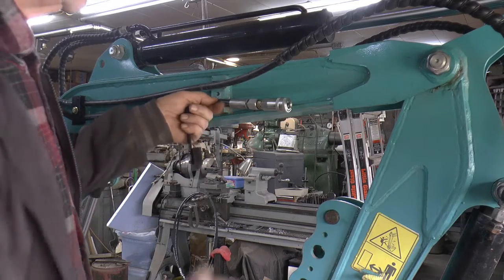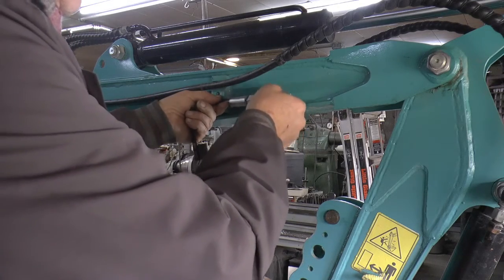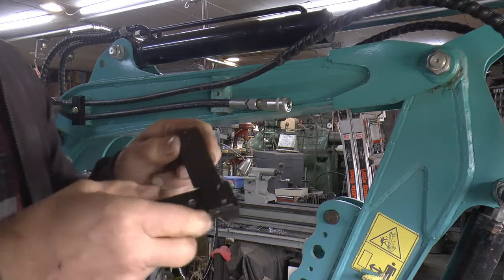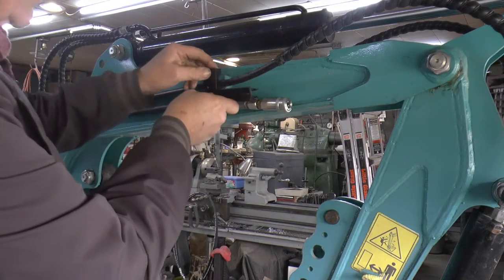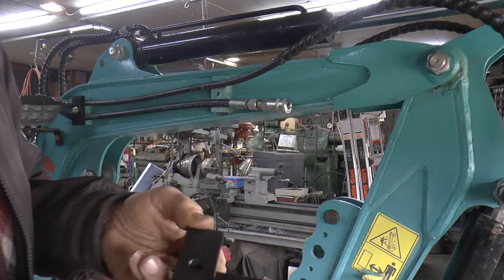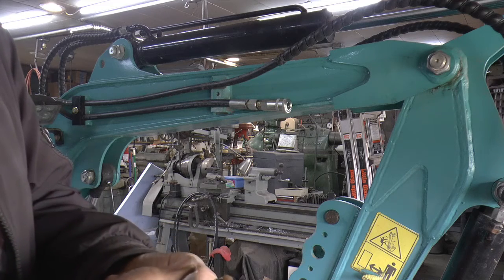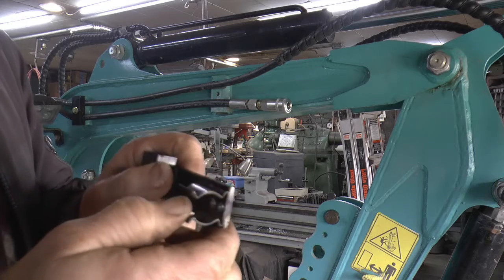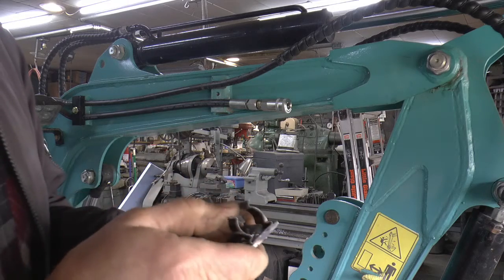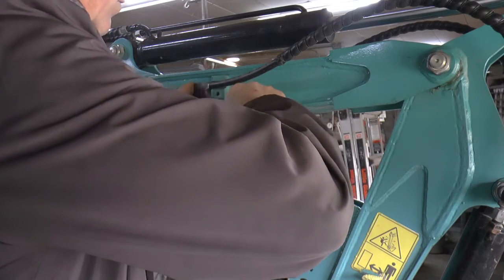Got my quick connectors mounted and I didn't like the idea of it flopping around like that. When you get something else hooked on there it's going to put a lot of strain on that right there. So I made a little bracket — took a little piece of band iron, drilled and tapped to mount it on there. And I put a little spring clip — I don't know where I got these, had them a long time. I think they were government surplus. Anyway, it's a pretty potent little clip — they just fit nicely on this nut on the end of the hose.